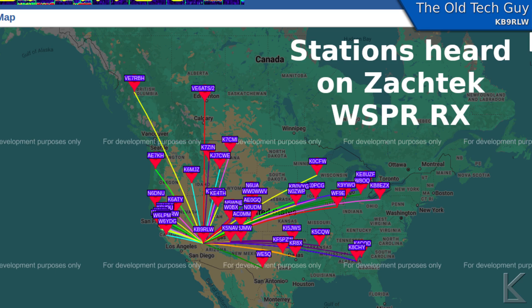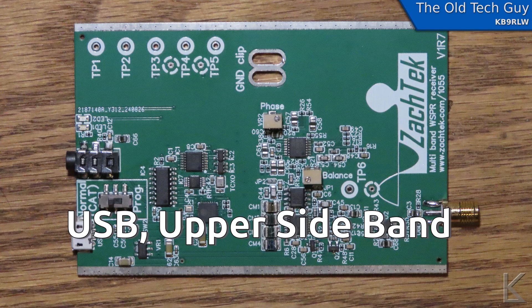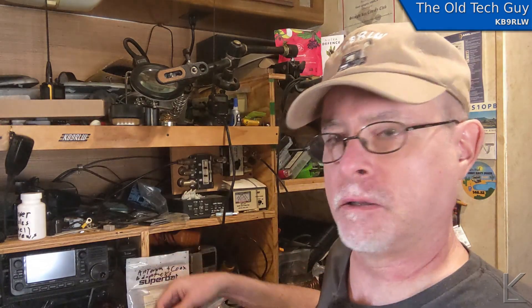Here's a picture of the board. You can see it's all analog circuitry on the right — this is a purpose-built analog receiver specifically for WSPR. It has a USB demodulator and a bandpass filter that is 400 Hz wide, centered on 1.5 kilohertz. You could not use this as a regular receiver. Somebody wanted to know what it sounds like, so I recorded WWV through it. As you can hear, you can just barely make out the clicking of the WWV signal — it's not useful as a regular audio receiver, but it's not built to be.